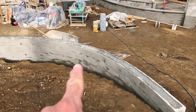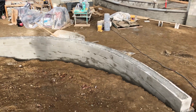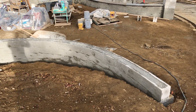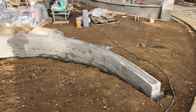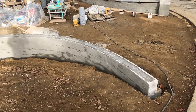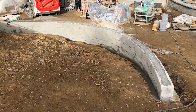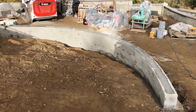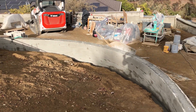What we're looking at is their gray material which goes on once it's mixed with water and acrylic fortifier. It's mixed to the consistency of about toothpaste. It's a little finicky with regard to how much or how little water is needed on both the wall and in the material, and the setup time — it starts getting a little crumbly after about 15 minutes. So I work with about 10 pounds at a time. It comes in 20-pound pails so I split that in half and then apply it with a masonry brush. It works really well but it's a little finicky as far as learning how to apply it.